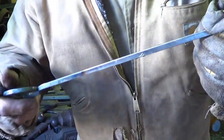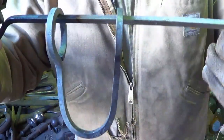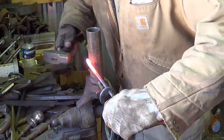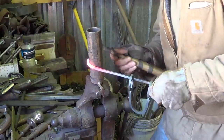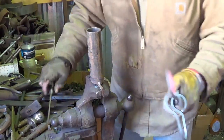For the final step on this piece, just put the loop on the other end. You could throw a twist in here if you wanted — that would look cool. But this piece goes on that piece, so it's probably a good idea to put this piece on before you put that loop on the end. Let me heat it up and get that other loop formed — and again, remember to put this piece on, or you'll have to open it back up.